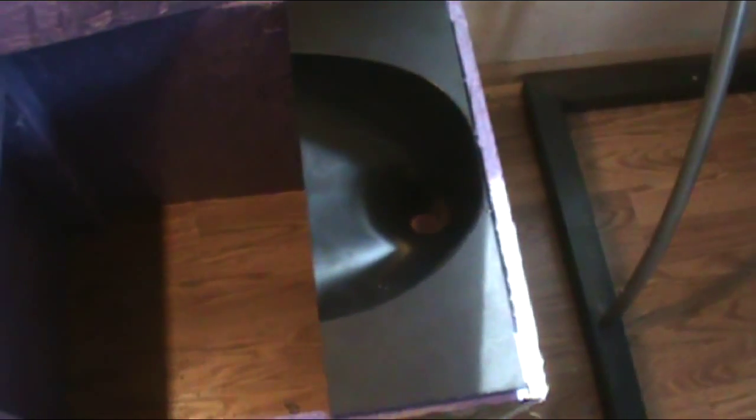If I had it to do over again I would use plywood, not OSB. Also, I should have made this a little bit wider so things could clear — I'm putting this in a very tight space in a school bus. I had to notch this out so the top comes down flush. I've started putting an oak floor tile that came with the house on as a skin, so I'll be working on that now.